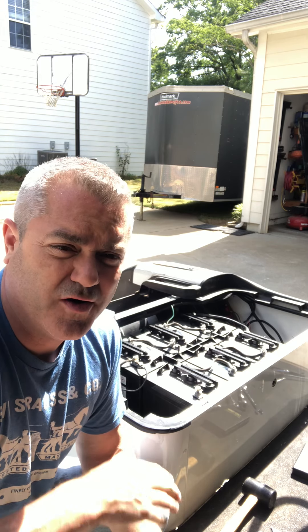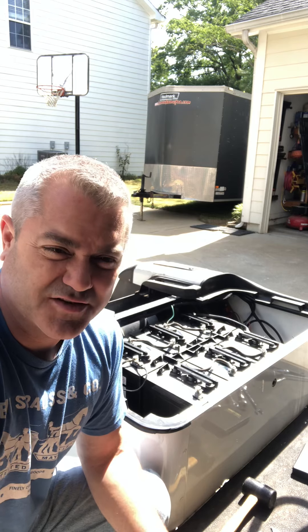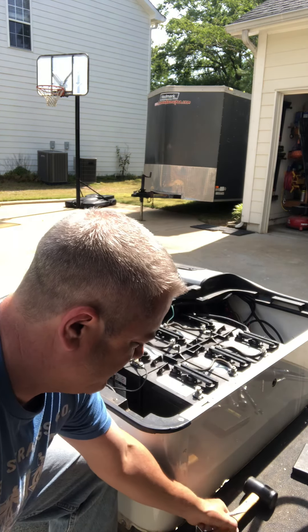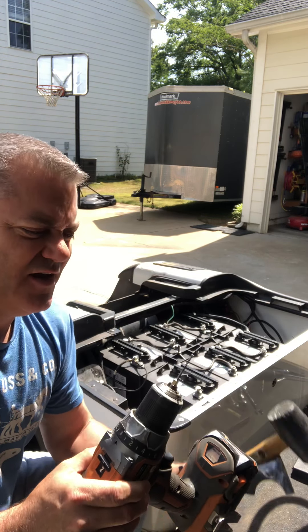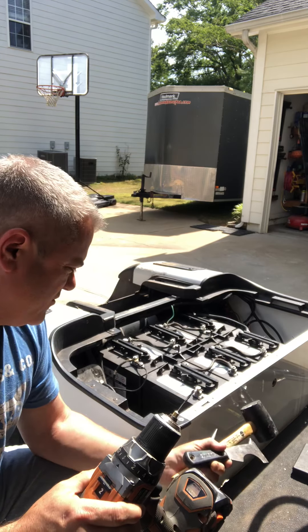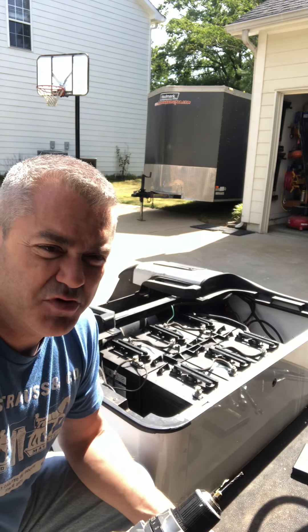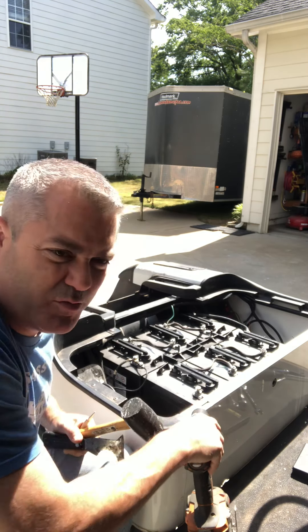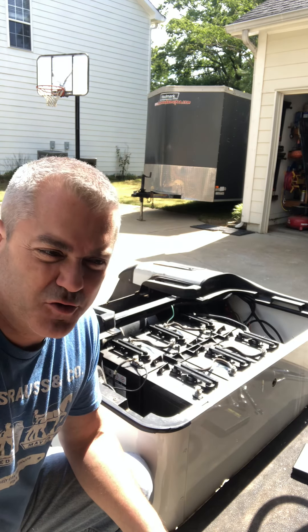I do it a different way — it's much better and a lot easier than going through several bits, pushing hard, only to have them spin around and not necessarily break the seal every time. What you'll need for this is really only four tools. You'll need a drill and a drill bit — generally on a 3/16 rivet, a 7/64 bit works just fine. It just needs to be a little bit larger than the hole, and you'll feel it give way just a little bit at the very beginning without having to put a whole lot of pressure on it.